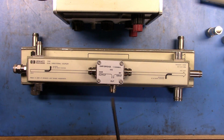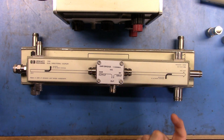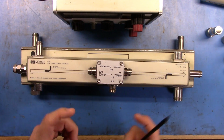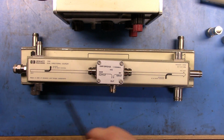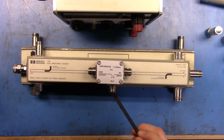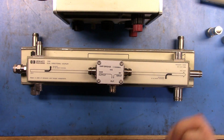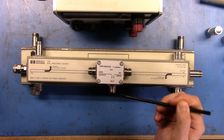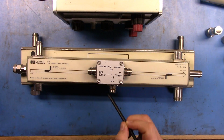These bridges should be balanced, resistive bridges, and there are many articles on this. Effectively, for a true SWR bridge, you should be putting a modulated signal in at a known voltage, and the modulation is usually around 1 kilohertz or something like that. Then you're going to get a reflected modulated signal at 1 kilohertz that has a voltage that is the proxy for the SWR, and a properly calibrated meter would enable you to read that. Really what you're getting here is basically the difference between input power and reflected power.